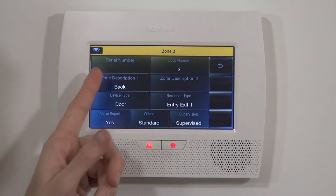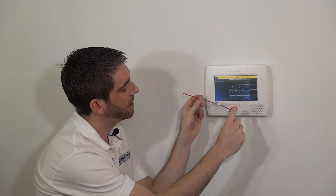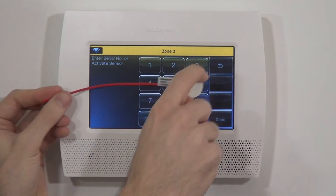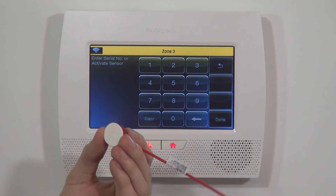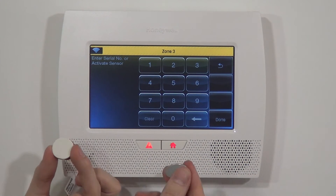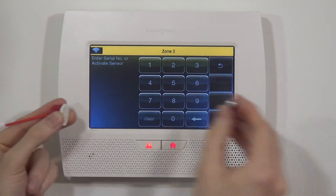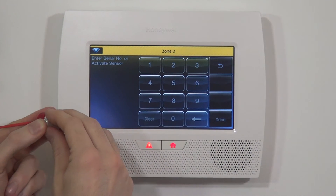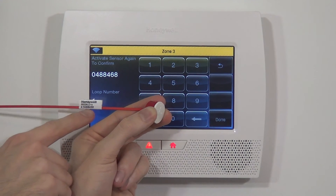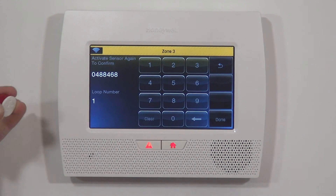The first thing we do is click into the serial number box. Just like with all our sensors, we can use the 7-digit Honeywell serial number — indicated with an alpha number followed by a 7-digit numerical string — or, better than that, we verify that our sensor is working and have the panel auto-detect the sensor and learn it in with the proper settings. With the proper orientation — oval to oval — we put the magnet close to the sensor and simulate our door opening. Doing it once makes it beep; close and pull away again for the double beep. We get our serial number: 0488468. Now we know the sensor works, the panel's working for that zone, and our parameters are right.